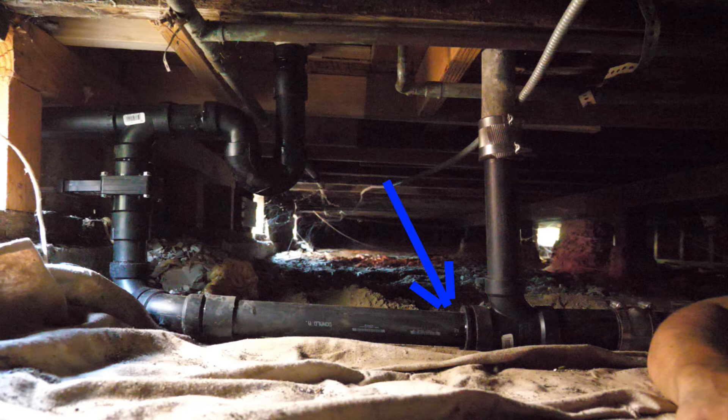And this side here is now connected to the gray water. So right here is the gate valve. If this is open, the gray water is going to go down through this pipe into this T and straight out into the sewer. If the gate valve is closed, the gray water is going to back up through this T.